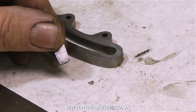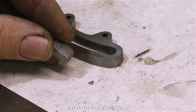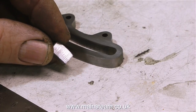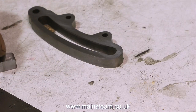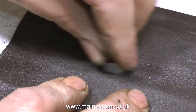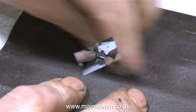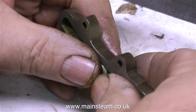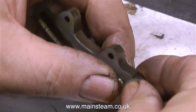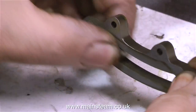I cut the end off the piece of bar stock and here it is - the almost complete die block. All I need to do now is put it back in the milling machine to square up the other end. After I'd done that I spent some time on the emery cloth just cleaning up the part, getting rid of any sharp edges and generally making it very smooth. I need it to slide in the gap just like it's doing here - there's no appreciable play but it's very smooth indeed. Not quite a piston fit, but very close.